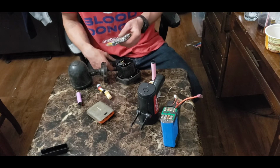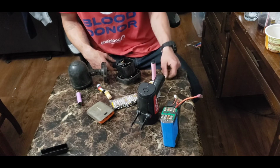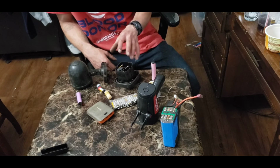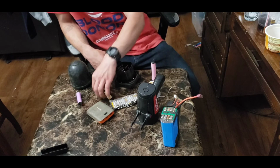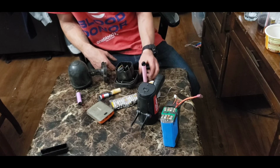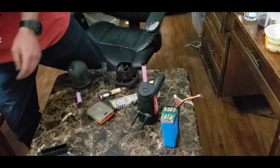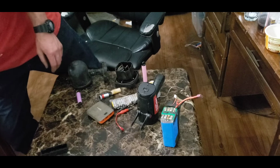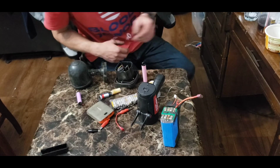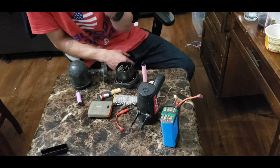And then if you want to make it where you don't have to take it out to recharge it, what I would do is just open it up. I made a video on my channel on how to recharge disposable e-cigs, and all you do is you get a USB cord and put 2 jumper clips on there similar to this. You just get 2 jumper clips and you cut open a USB cord, you find the red and the black cord, you put these guys on there, and voila, there's your charger.